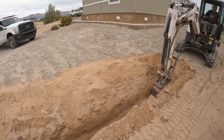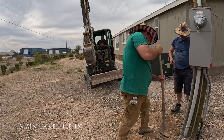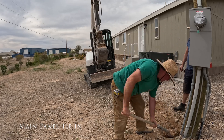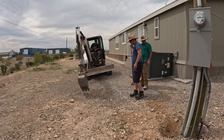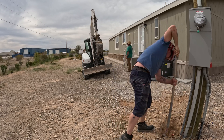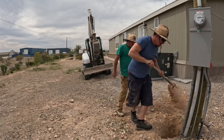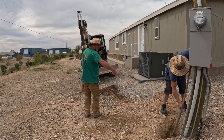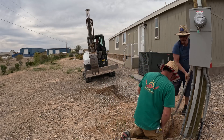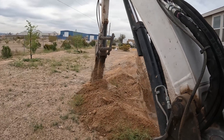The back of the solar ground mount was actually six feet deep — that's the deep end because the panels are at a 30-degree angle. The short end was only four feet deep on those posts. We're also going back quite a way from the ground mount location to the power pole and main panel — it's actually a little more than 100 feet.